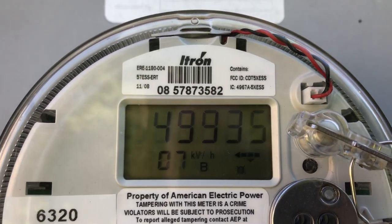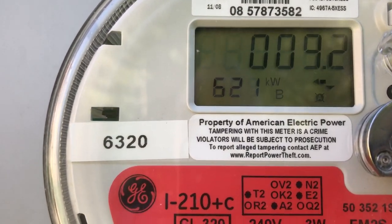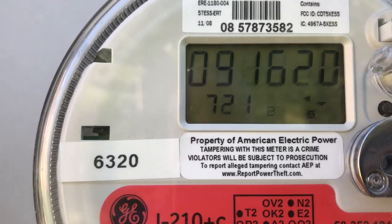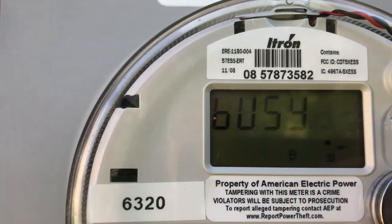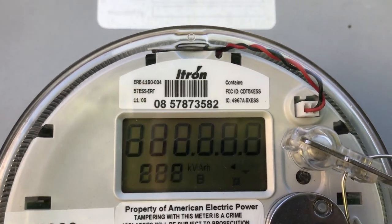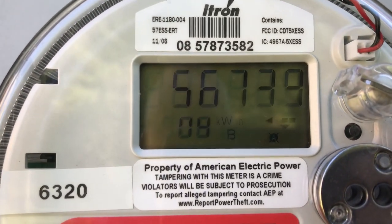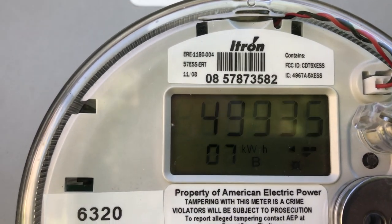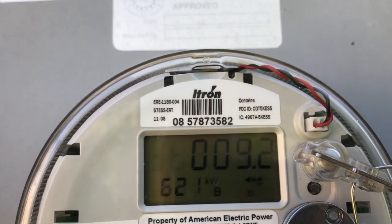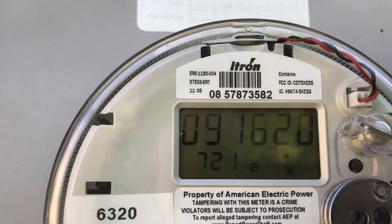All this is completely seamless, and when you get your bill, they're going to be registering both that 07 and that 08 register. The difference is what your electric bill is going to be based on for the month. You don't want to turn on your equipment before the meter is changed, because before that meter is reprovisioned, it can't tell which direction that electron is flowing. You'll get charged not only for everything you use, but for everything you export as well.